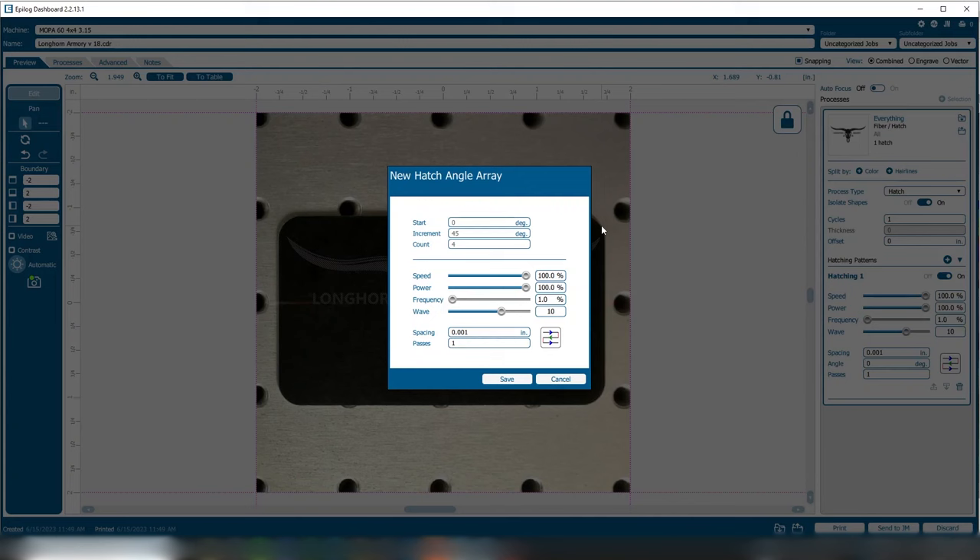Now we're ready to do a focus function on the material. This graphic we're going to engrave on some black anodized material. Black anodized is sometimes hard to see with the red dot pointer. I'm going to press the focus button on the control panel — you can see the X created by the galvo's red diode, and the secondary lobe coming off. We're just going to move that until it's centered on that crosshatch and then we're ready to go. You could also measure the thickness of the material and program that into the control panel, or use the manual focus gauge. Customers will find one way that works well and probably stick with that.